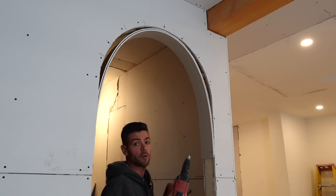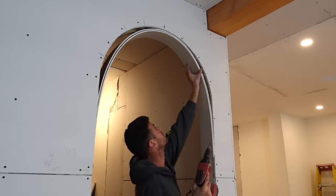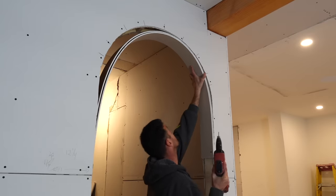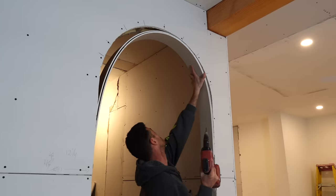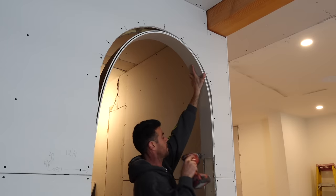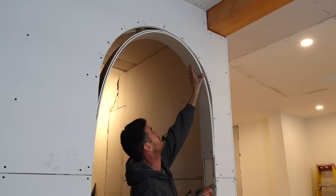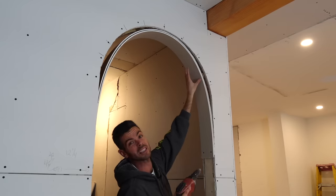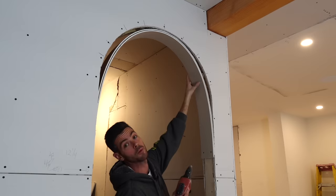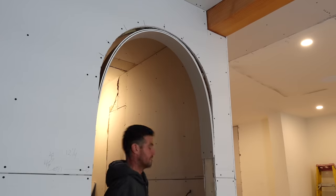So a regular drywall screw easily goes through both layers. So right now what I'm gonna do is I'm gonna eyeball them and make sure that it's straight before I put a second screw in down here, because there's not gonna be a lot of adjusting room if you install your pieces out of square. I also cut these pieces about a 16th bigger than the actual opening so that I can shave down the edges and get a nice tight fit.